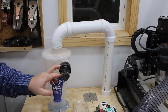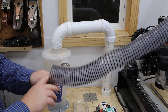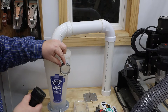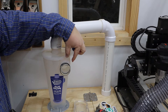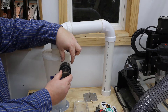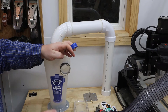I want to retain the ability to use this dust deputy cyclone for both my smaller shop vac tools and this larger dust collection hose. To get the adapter to fit for my shop vac I put a layer of electrical tape around the cyclone's pipe. To let the dust collection hose fit, I'll put a thicker layer back there so this piece goes on tight on its part, but further back it steps up larger so the dust collection hose tightens back there better. The electrical tape will help me get an airtight seal, which is very important with dust collection.